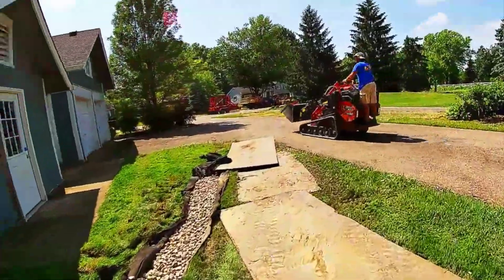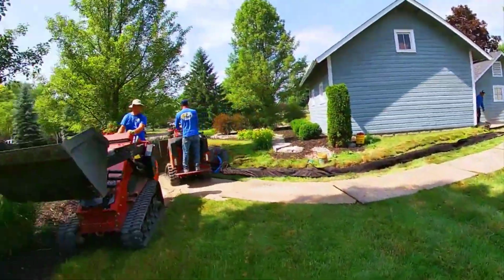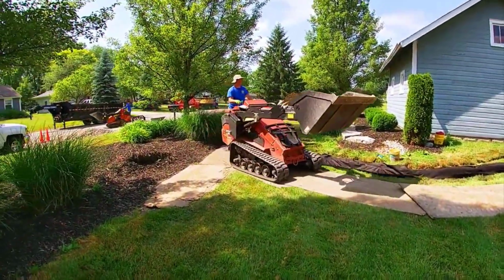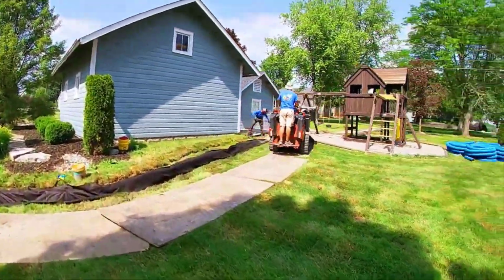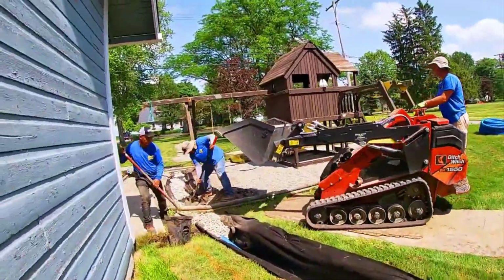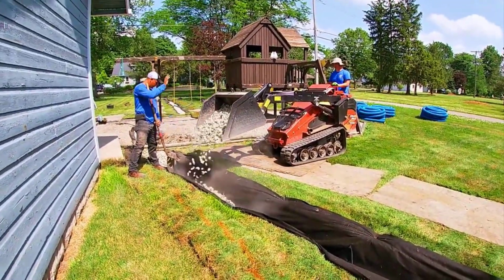See, all this driveway water and everything would get trapped in this green belt in between these outbuildings. We went ahead and ran our French drain right in there. We're going to grab up all that water and get it down to a storm drain at the street that we ended up coring and tapping. What core and tap means is we literally take a hammer drill with carbide on a core drill, and we go through 12 inches of concrete, and we put a piece of Schedule 40 in there. We hydraulic concrete the Schedule 40 in, and then we connect our French drain pipe to that.